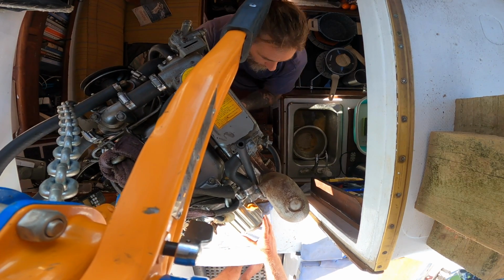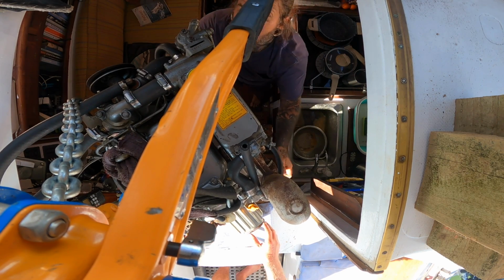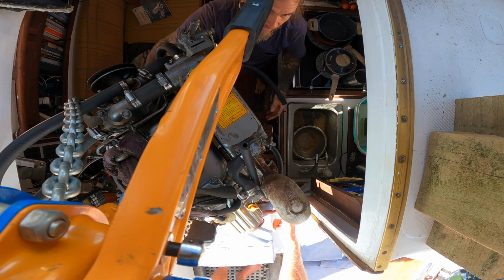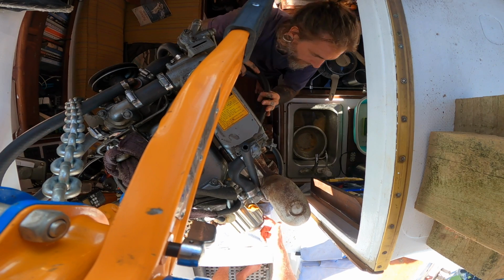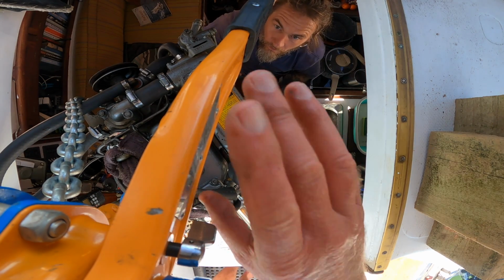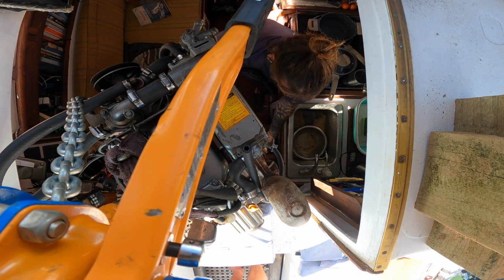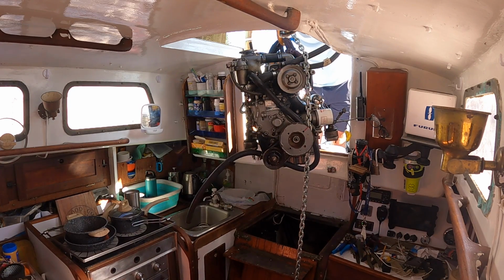She's in. So now what we've got is the flange on the back of your gearbox, okay? That's got to clear the top. So we'll probably have to pivot her in, then twist her, if you follow me. Yeah, I always have to spin her as I'm bringing her in. Cool. You visual with this, because that's the sharp bit. Do you want me to come up a tiny bit more to get you clear of that a little bit? Yeah, let me actually get rid of everything down here first. Yeah, no dramas. Gantry's doing the job.